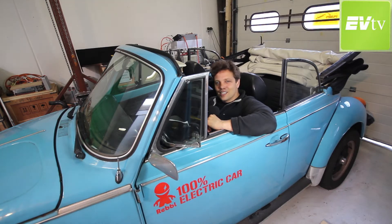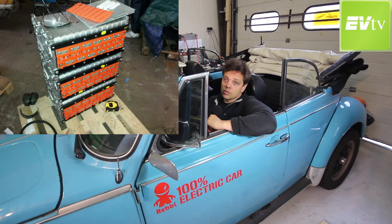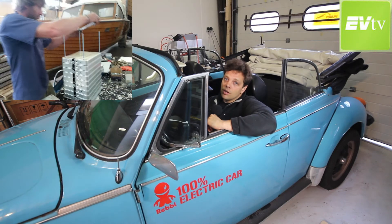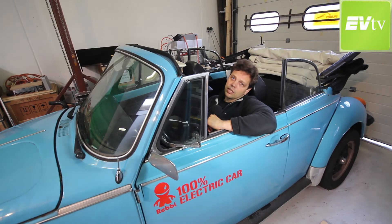There you have the Tourist — such a lovely boat. It already had an electric system installed a couple of weeks ago. We put the battery pack that was originally in my Glastron — the Winston yellow bricks, the 90 amp-hour bricks — in there as a placeholder while we were waiting on the often-delayed Better Place packs. Now that they came in, Bidens took them apart. He had to go a little further than we did to conform to the system voltage of around 96 volts. He took apart all the cells and made banks of 13 units, paralleled a few of those with some extra monitoring systems of his own preference. That way he was able to install 60 kilowatt-hours of the Nissan packs in the Tourist.